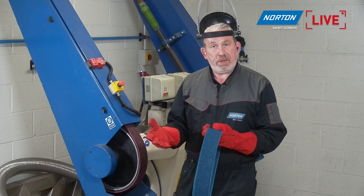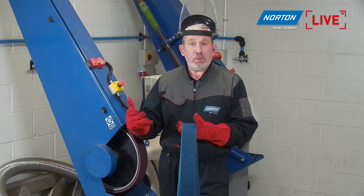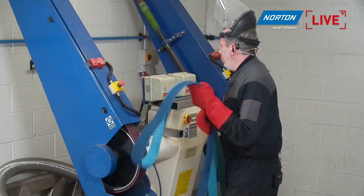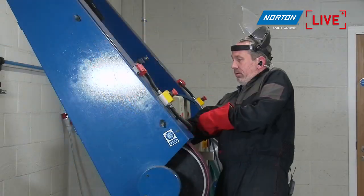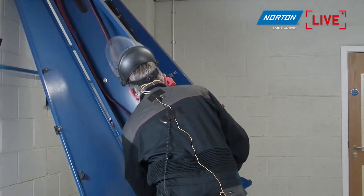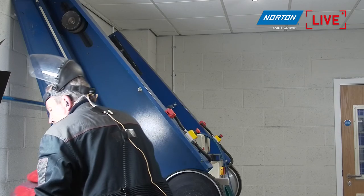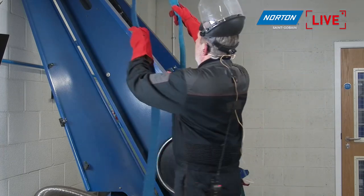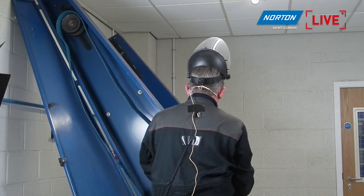And again, we were discussing on the PowerPoint how this product can help you to reduce grinding steps. If you're using conventional coated, we can get to a No. 4 finish in 4 steps alone. So it's really handy. It's a very time consuming operation. Okay, let's get this belt off. Untension. Put him down there in my perfect storeroom on the floor. Let's get him on.